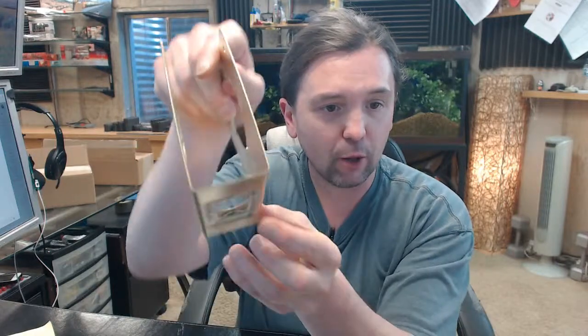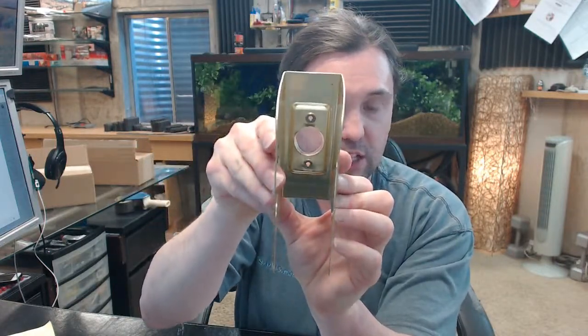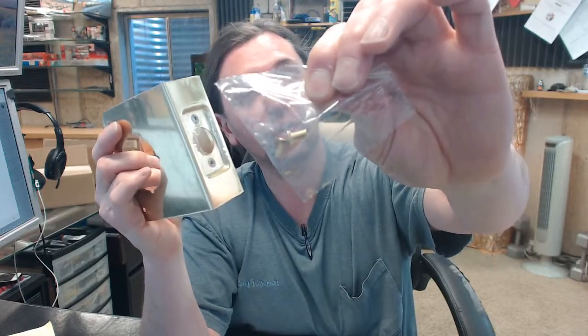The -CW stands for the fact that this is a mortised edge style preparation. These door reinforcing plates can be made in a mortised style, CW, or a VF, which is a flat front. The CW is more common, and that allows you to attach the latch bolt directly to the edge of the door reinforcer by use of the included 8-32 undercut flathead machine screws.